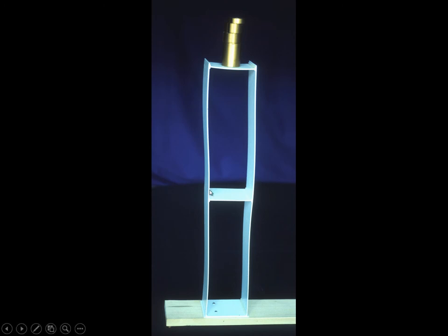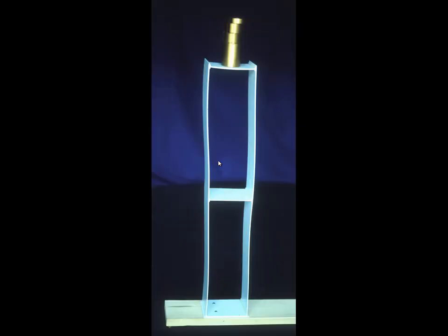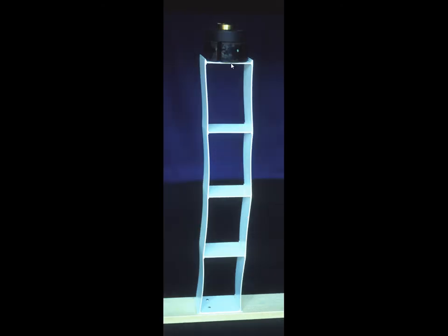Now it's actually able to handle a small amount of load. If we do that periodically — like at this intermediate point — there's a huge amount of slope right here, but if we introduce an element there that pulls it back to vertical at that point, the lateral movement is drastically reduced. We were able to quadruple the load here by reducing the effective length of this column to half of what it was before. If we do that again, we're able to quadruple the load again, each time reducing the lateral sway along the vertical member. If we can pull those maximum slopes back to vertical, then the column becomes much stronger.